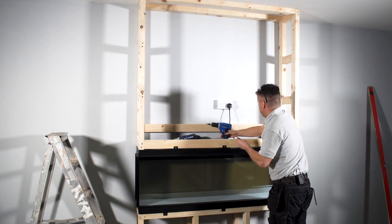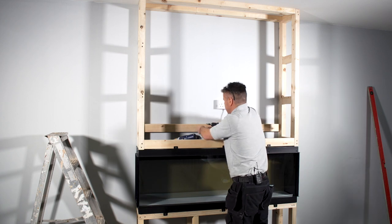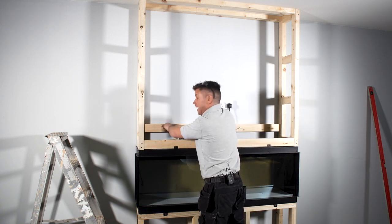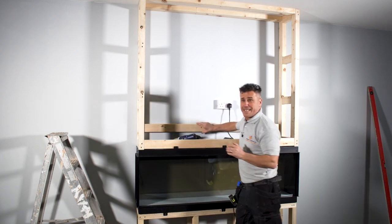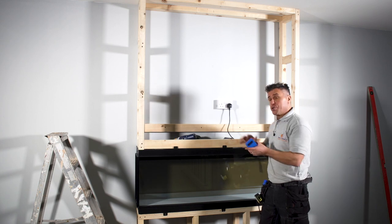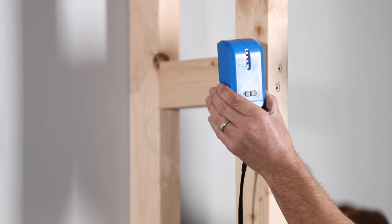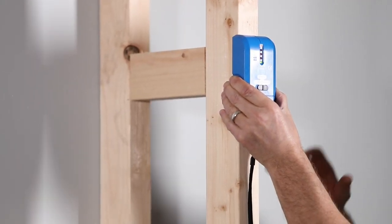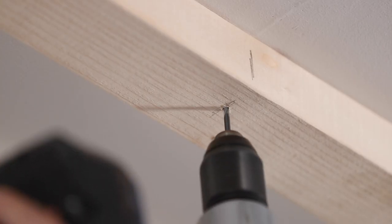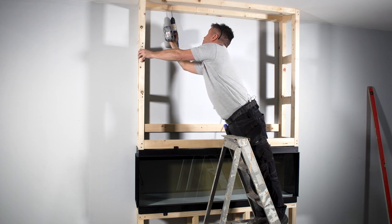I'll drill four clearance holes into this back section of timber and screw them firmly into the wall. Remember I've got wooden boards behind my plasterboard, but at home you may have a brick wall, so you'll need to drill with a masonry drill bit, put in a raw plug, and then drive your screws in. For fixing the frame into the ceiling, you need to find the beams above the plaster. Use a stud detector — when you put it across your ceiling board it'll find a piece of timber behind it. Once you've found the timber joists, mark with a pencil, drill pilot holes through the wooden frame, and drive your screws into the ceiling boards, biting firmly into the joists above. I'm applying six individual four-inch screws.